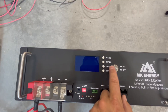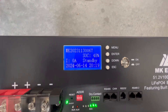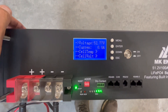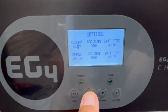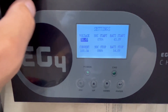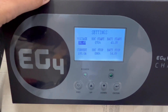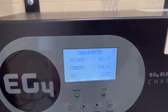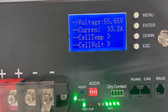We'll power on the BMS. Our state of charge is 48%. We've got 52 volts. I'm going to change the charging voltage on the charge verter to 56.4 — we could probably do 57 volts to charge it fully. I'm going to do it at 100 amps because I want to max this out and charge the battery quickly. The charge verter is rolling, we've got 53 volts, up to 14 amps and rising. At 92-93 amps, I'm going to be charged up probably in the next 20 minutes.